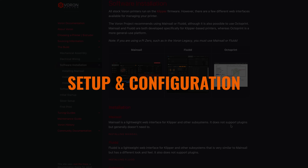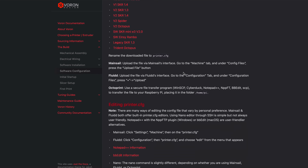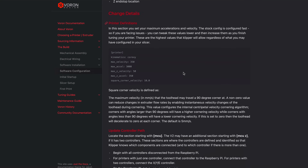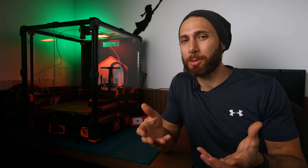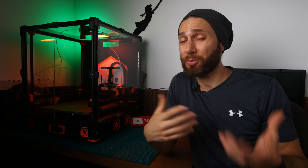With the machine up and running, the next step was to set up all of the various software and firmware, and I have to admit this part wasn't fun for me. Installing Klipper and Mainsail on the Raspberry Pi are not difficult at all if you're reasonably familiar with a command line, but there are a few areas where you can run into trouble. I wasted hours trying to get OctoKlipper Pi to run, only to figure out there was some rare, bizarre incompatibility between my SD card, OctoKlipper Pi, and this version of the Raspberry Pi — which cost me a couple days of frustration before I eventually landed on using Mainsail instead.